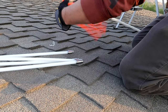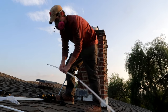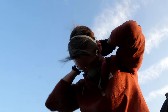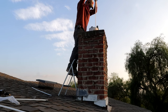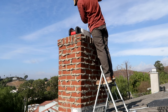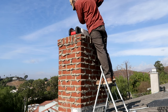From there, assemble your cleaning brush — in my case it's a matter of attaching the fiberglass rods together and putting the brush attachment on the end. If you have someone in the house below, ask them to turn on the shop vac for you; otherwise you'll have to climb down to turn it on. Make sure you have a good respirator, safety glasses, and gloves to protect yourself from flying debris and potentially carcinogenic dust. If you have a brush that attaches to a drill, once you've fed the rods down the chimney and reached the length of your liner, attach the other end to the drill and make sure the chuck is tightly connected — you don't want to drop the rods down the chimney. I like to start at the bottom and work my way up, but just work your way through the entire liner thoroughly. Once you think it's clean, use your flashlight or camera to verify and clean any spots that didn't get cleaned well.